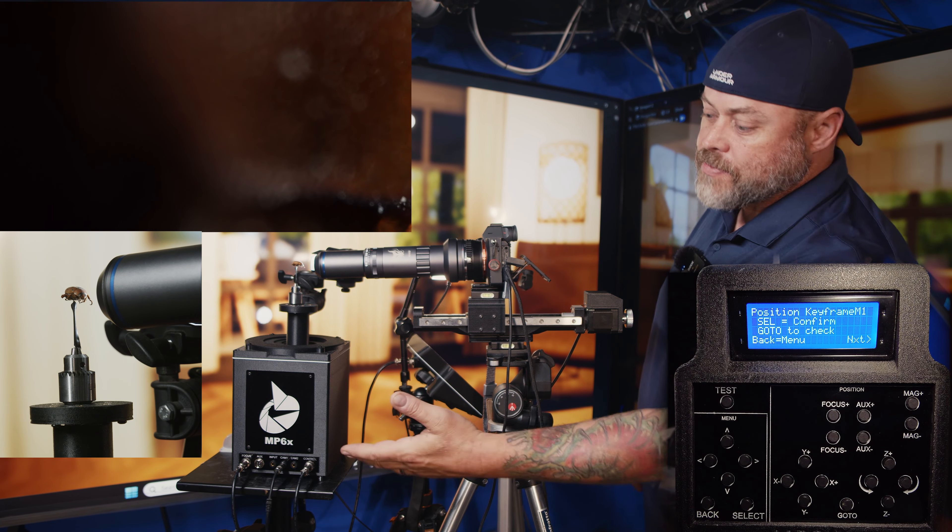On the M1 rail right now is a Sony A7R III with a Laowa Argon lens set up at 10x magnification. For this demo I didn't see much reason to go beyond that - I wanted to keep things easier to control. However, most of the time when testing I do use 50x magnification to ensure positional accuracy is dead on. The casing is made out of a thermoplastic called ABS GF25 - an ABS plastic with long glass fibers embedded in the filament - giving it excellent structural strength.